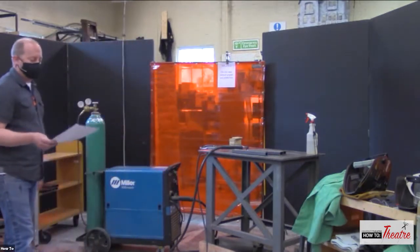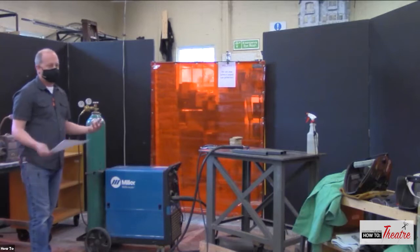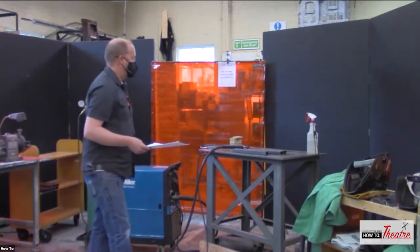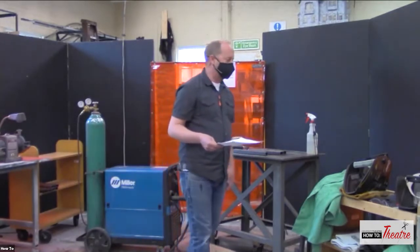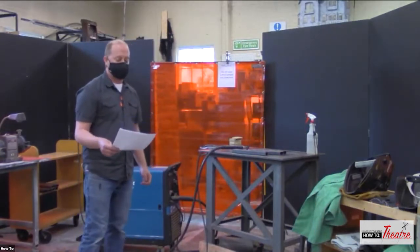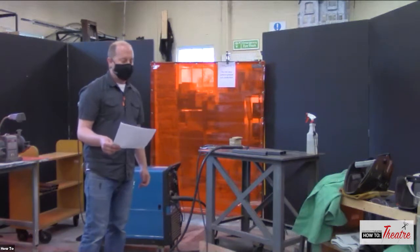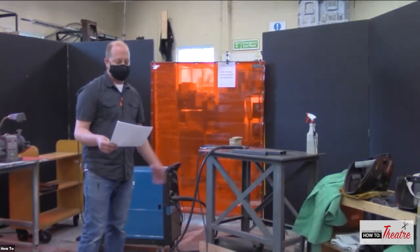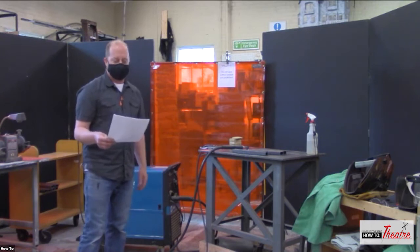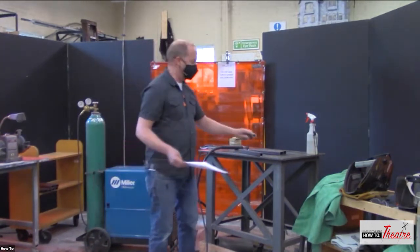The type of welding that we do here in University Theater is MIG welding, which is an electrical arc welding. So you have electricity, so you have the shock hazard, and you need to protect yourself from that. Vision damage. This is a very, very bright light when you're welding, and we'll get into some of the PPE. There are gases that come off of this when you're fusing them together because you are melting things, especially things like galvanized and other items like that. There's also ultraviolet radiation that comes off of it, so you have to be careful about that. Fire is bad. And also cuts from sharp objects, because when you cut this stuff, it can be very, very sharp.